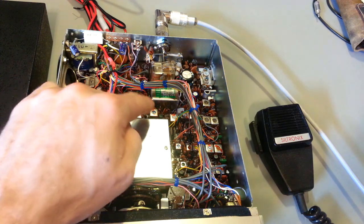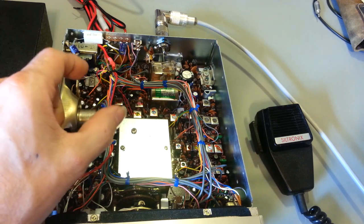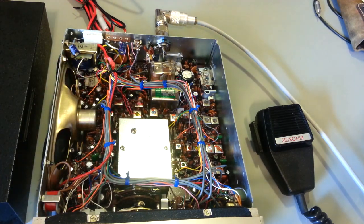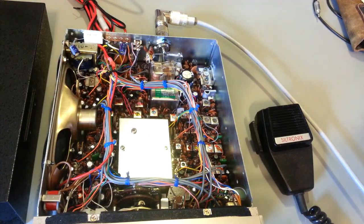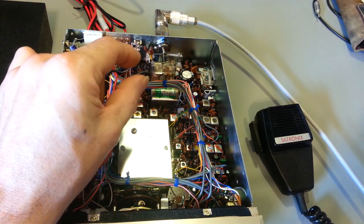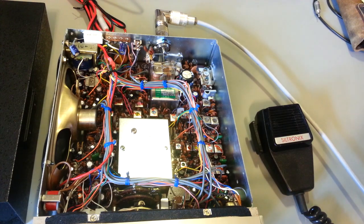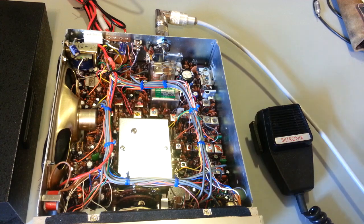Yeah, and I'm one of those people, when it comes to sideband crystal filters, I want the narrowest I can get and still have enough audio definition for good, clear conversation. But like I say, the narrower you can keep that frequency range, actually the better it's going to sound, because that's the only thing you're listening to, is the person talking. You're not listening to a bunch of other crap.